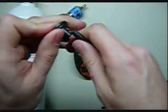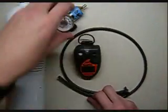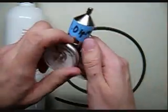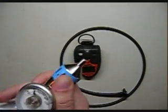First thing you want to do is take the calibration nipple and attach your tubing to it. The reason to do this now is because generally once it's asking you for it, you'll fumble with it, and it's much easier to get it set beforehand. Take your regulator — always open the regulator up before you put it on the calibration gas cylinder. The last thing you want to do is put a closed regulator on a cal gas cylinder, as it'll force room air into the cylinder space and it can distort your readings on the calibration gas.